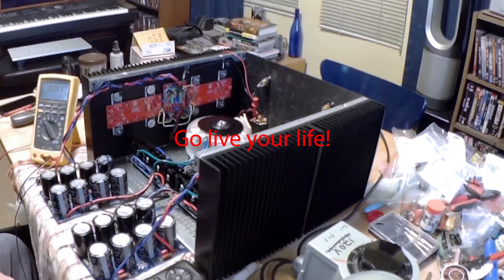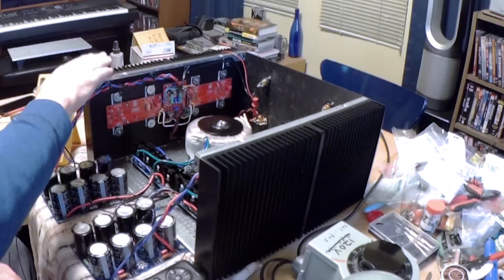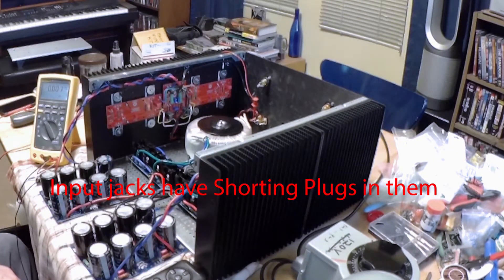I have fuses in the back — they are 2 amp slow blow types, which is what I normally use on my preamps. These are going to be grotesquely undersized for a power amplifier; it should be closer to 10 amp slow blow. I have some on order. But right now, with the bias turned all the way down, we should be able to at least see if they will hold up with both amplifier channels running in the idle state.